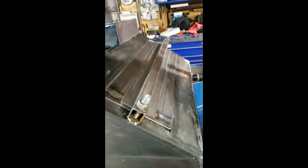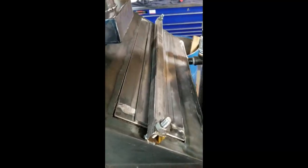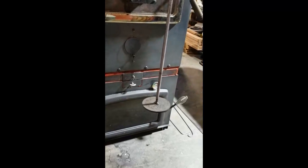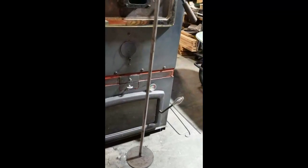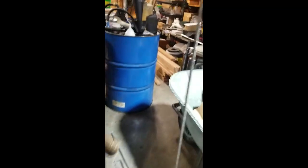I just finished cleaning out the burn chamber. Basically I just take two nuts off, the plate comes off, and then the heat exchange tubes are right there. I have a tool that I made that slides down and scrapes the insides of the exchanger tubes. This is my little cleaning tool — it's one of the cutouts for the exchange tubes, a three inch disc, and all I do is slide that down in there: once down and once up, exchanger tubes clean. Very simple to clean this thing out.